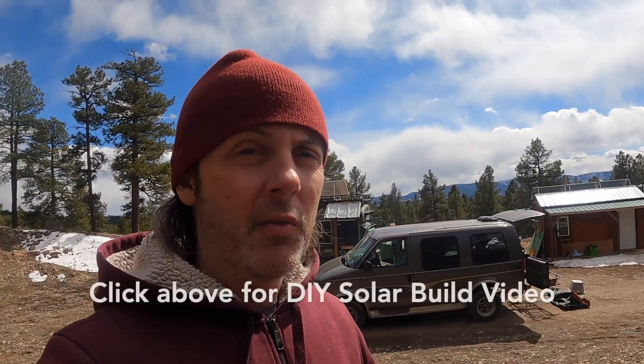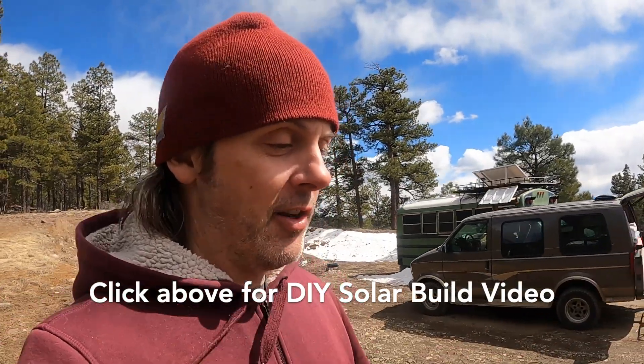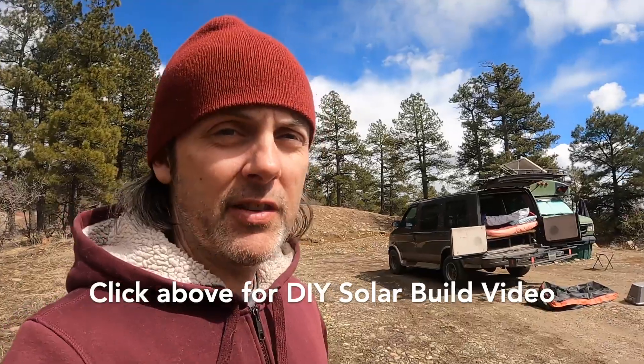Welcome back boys. In this episode I'm going to show you how to build an insulated battery box for your lithium-ion batteries. Lithium batteries can be discharged in almost any temperature, but they have to be above freezing in order to charge them. Typically that's not a problem if you have a real house, but we just have a solar shed. When we're not here it is not heated, so they likely would not charge until midday or later when the shed heated up due to the sun.